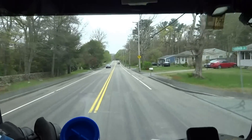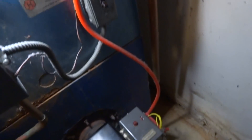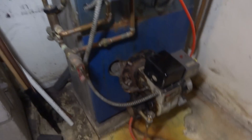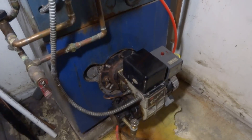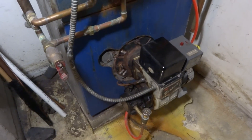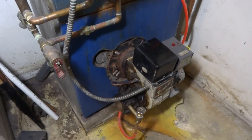I'll try to get you some shots — he's going to be around, it's a tight area too. It's an overhead line. They replaced the tank a couple years ago. Oh, it's got a Webster pump — there's no filter on that one. He said it'll start hesitating. Yeah, that's a Webster pump. It's still definitely hesitating. You can hit the pump line now — then it'll stop puffing. Yeah, it's starving for oil — she's starving for oil.